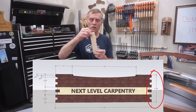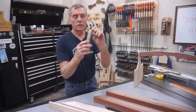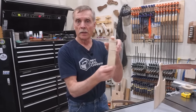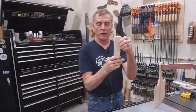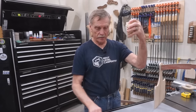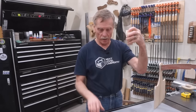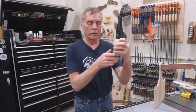And to get everything just so, I took a piece of wood and ripped it to exactly 5/8 of an inch, and I dialed that in until 11 of those little pieces lined up together make exactly 6 7/8, so that I know on the bottom of the tool tote, three of those lugs are going to be the bottom piece. That's what these are. Because they need to be glued up, these pieces are a little wider than that amount. It'll get trimmed off later.